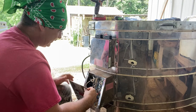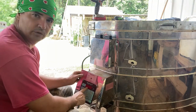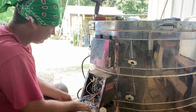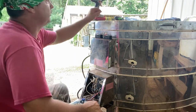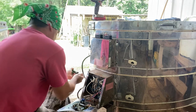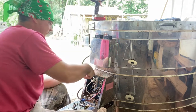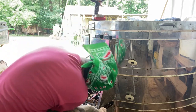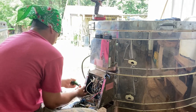I divided it and got it down. Now my power is off — you need to check that the breaker is off before you do anything in electronics. You make sure you kill the power. Some people get a thrill out of working on stuff hot — I don't. I don't claim to be an electrician or professional at it, but I've worked on this until I know how to do what needs to be done. This is a Phillips head on one side and I just take my needle-nose pliers.